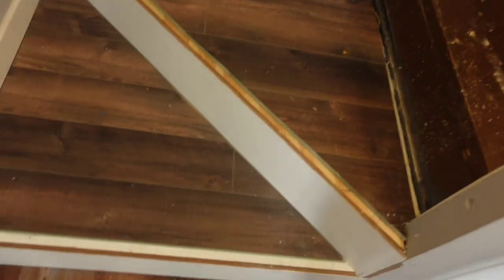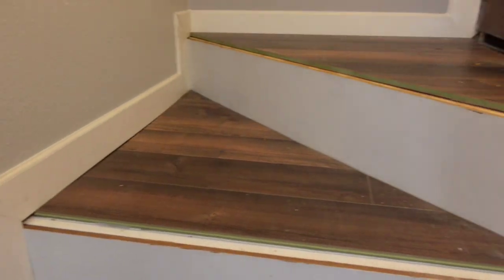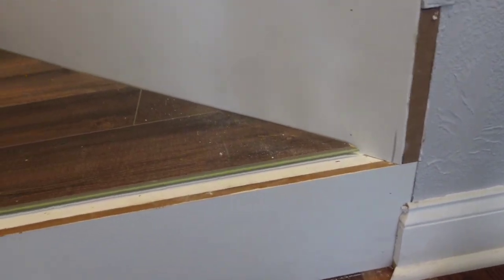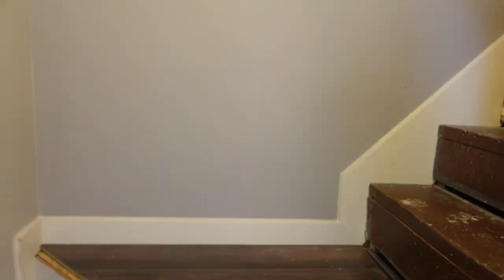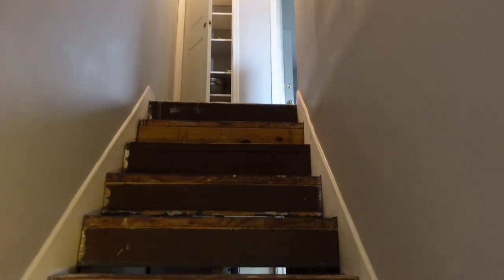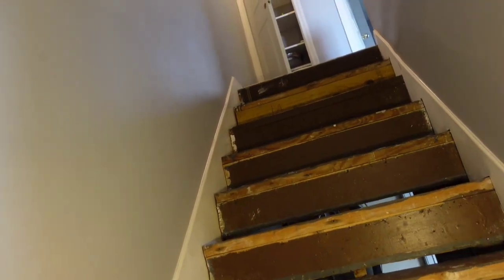All right team, let's take a look at where we are on the progress. So here are the stairs. For those just joining us, there was a lot that went on. I had to redo the risers down here - they all looked a mess. We're going to do carpet on the rest of that, but I was able to make some custom baseboard with my router. I reran all the base back around and by making my own, I was able to make my own skirt board and tie it in.